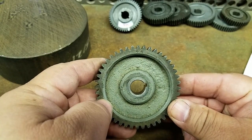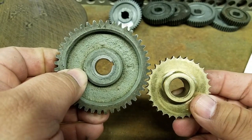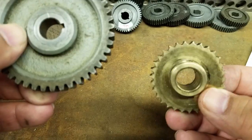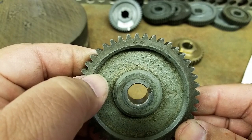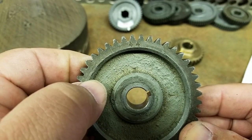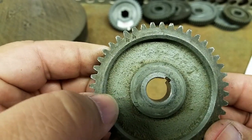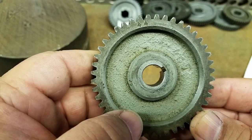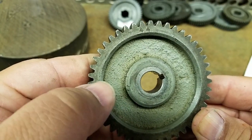Here is the gear I just removed from the lathe — you can see the difference in the way the teeth are. This plainly displays how much wear is on the little bronze gear. I believe it's a spur gear, 14.5 degree pressure angle. This one you can clearly see is 44 teeth. So we need to determine the diametral pitch of this gear, which coincides with all the gears that are in the gear train — at least the ones outside of the quick change gear box.